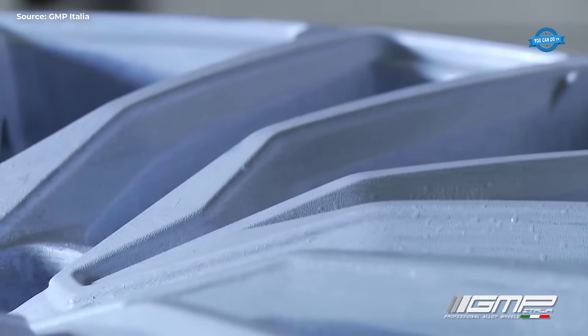The tool shop is equipped with state-of-the-art CNC machining centers, EDM machines, surface grinders, and other precision equipment to ensure exact fabrication of tooling components. The foundry utilizes three different alloy types in serial production, with each alloy melted in dedicated shaft furnaces to prevent contamination and ensure consistency. Stringent quality controls, including density index and K-mold tests, are regularly performed to maintain the integrity of the melted alloy. Automated die casting cells form the backbone of foundry operations, with shot parameters meticulously controlled and recorded for every cycle. Integration with the ERP system enables real-time monitoring of overall equipment effectiveness (OEE), enhancing operational efficiency and traceability.